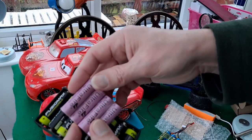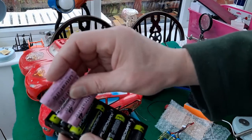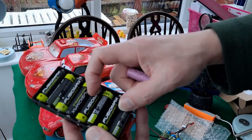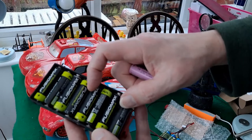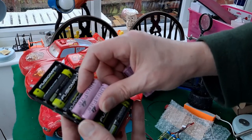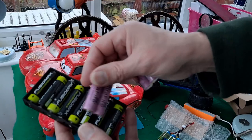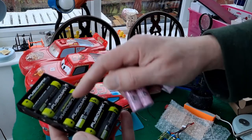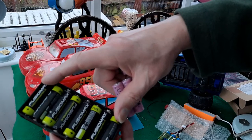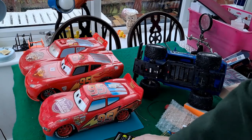Nominally — fully charged — probably 4.2 volts. So three times 4.2 is 12.6 volts. So in that case you want three of them in there and five dummies. If they've only got four double A batteries in your car or whatever, then you've got a problem. If you put two in, you're going from four times one and a half — six volts — to seven and a half volts, so you're putting a 50% increase in voltage. Or you just put one of them in there: instead of six volts you've only got about four volts, so you've got less voltage. Four is a problem, five is ideal, and eight is ideal. Other than that, you've got to make a choice: do you want to over-voltage it or under-voltage it?